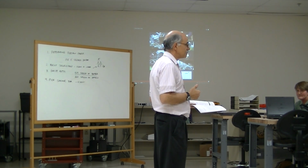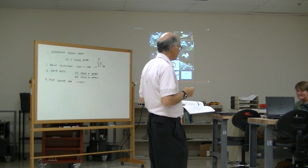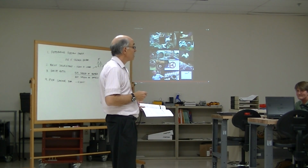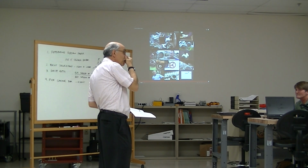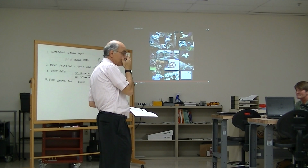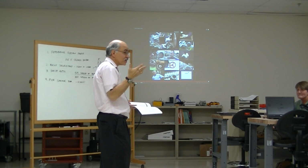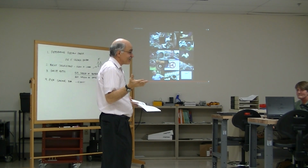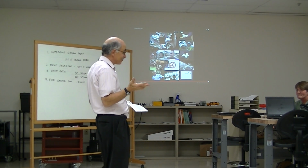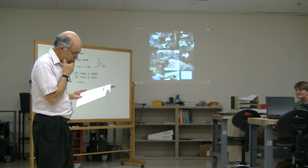One thing you're missing though. A larger sheave will probably cost more money. And if you have a larger object, the inertia from stopping it would have more backlash. Maybe. Would it wear faster? No, they don't wear any faster. But isn't it going to have to be longer? Oh, yeah. If you've got a larger sheave, you're going to have a longer belt. If you've got a longer belt, it generally costs more money. So there's a couple of different reasons.